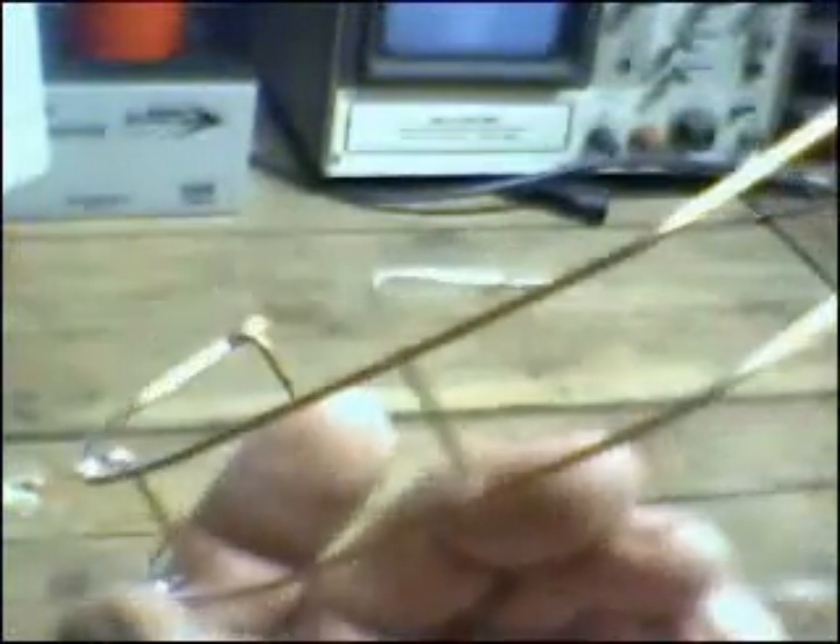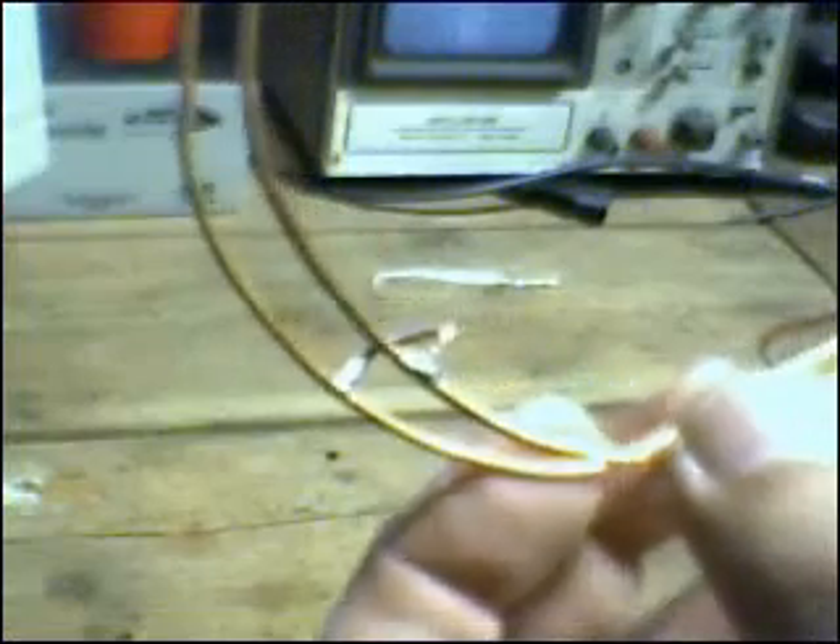I don't know if you can see this, but these are two 14-gauge copper rails that were laid out straight on my bench when I started. I cut a number of identical pieces of 14-gauge copper — I wish I could move this camera into place — and bent them approximately 3/16ths of an inch from the end with a pair of needle nose pliers, and soldered them to the rails.